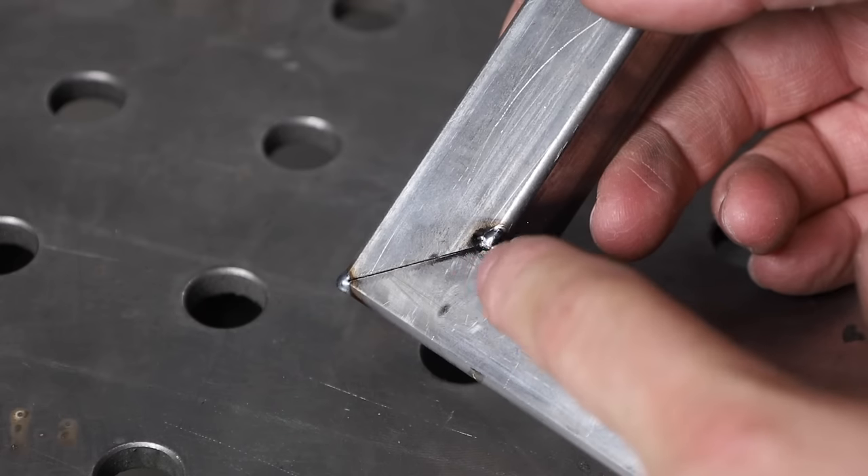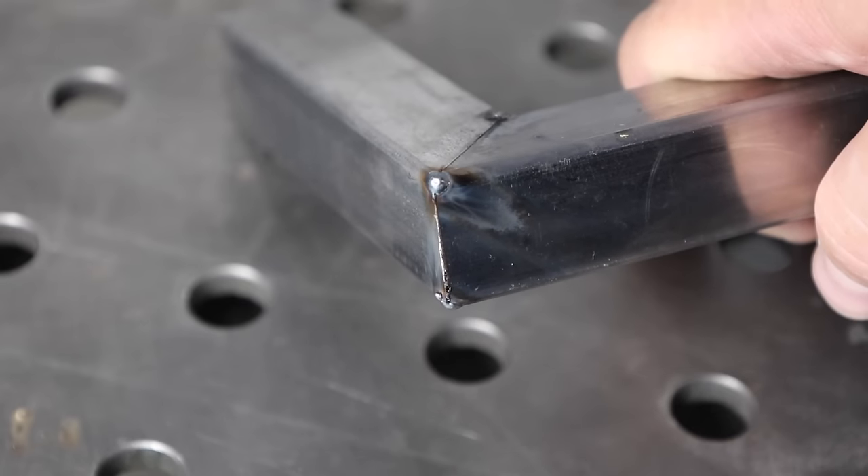These are the types of joints you learn in each of my online courses. Let's look at this mitered corner — on the side there's a butt joint where the material is butted right up against one another. In that case, it's best to just drag right along and follow that seam at a relatively steady pace. On the outside corner joint, this is the joint most likely to melt through. On this thinner material, one of the best hacks is to weld vertically down — it helps you move a little faster, you won't build up as much material, and you'll penetrate just fine.